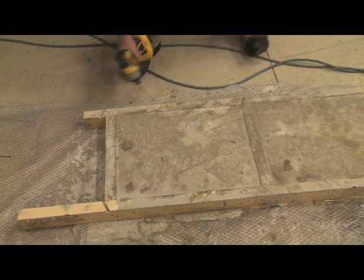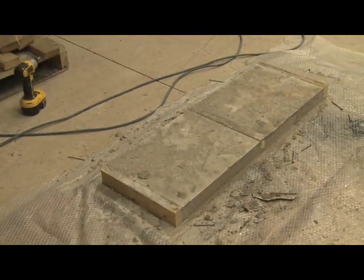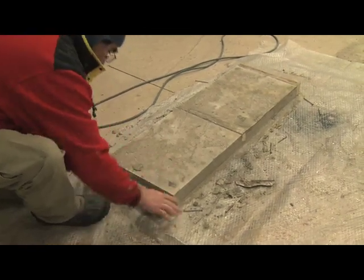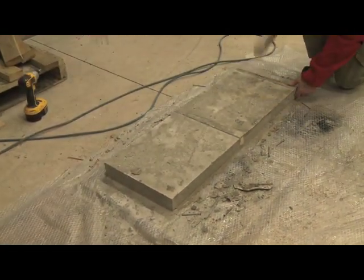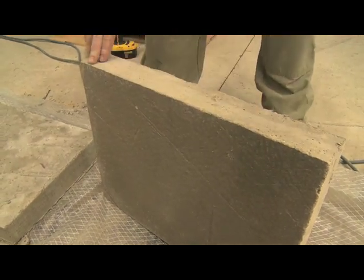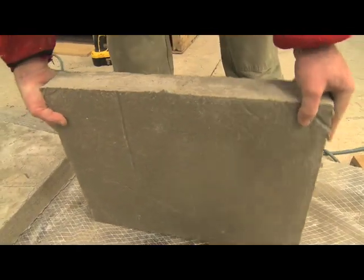Today we're deforming the capping slabs for the masonry heater. These were cast in our lab here at CCHRC yesterday afternoon. And these are the parts that actually form the top lid of the heater body and the two bells. So we've just taken these slabs out of the forms, and we can see that there's very little air voids all the way around, and that's a good sign. The more air voids in there, the weaker the refractory concrete would be.